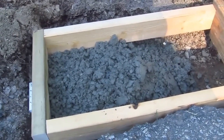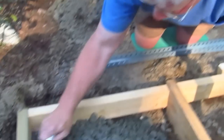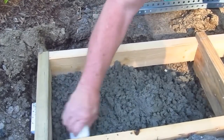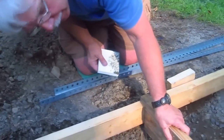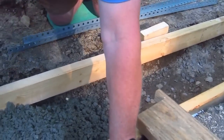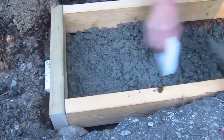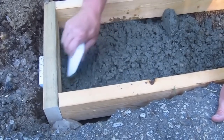You can see how high it is. No sense using this tool right away. I'm going to take this little block of wood and just move it around a bit. We already know that this is four and three-quarters and the form is three and a half — it's a two-by-four. So we have to get the concrete an inch and a quarter below the form. You can see that right there, so I might as well pull some of this extra concrete down this way — it'll be much less work for the tool.